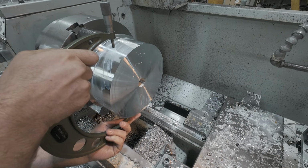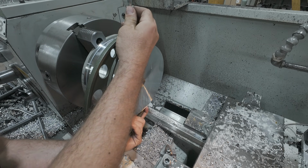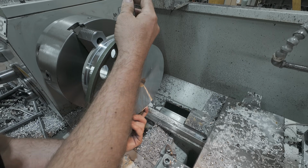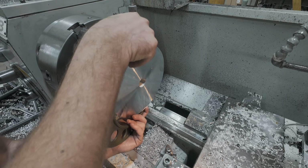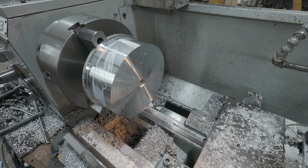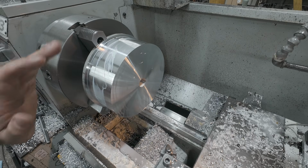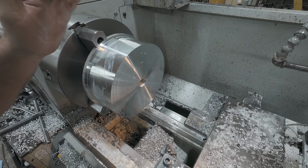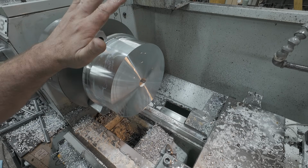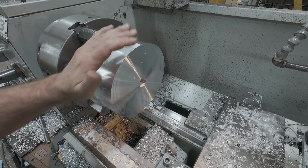Now we'll grab our 9-inch micrometer here, and I already checked this to a standard, and we are good to go. We were at 9.350, and we got to go to 9.280. And by the calculations, this is going to be a loose fit in the cylinder when it's cold, but once it's up at running temperature, about 350, 370 degrees, roughly, we're going to have about 10 thousandths of clearance between the piston and the cylinder wall, which will be about perfect.